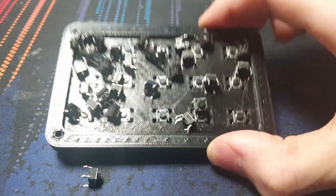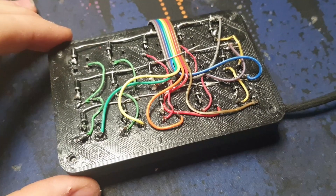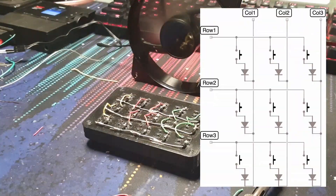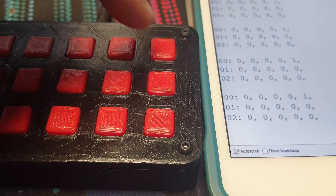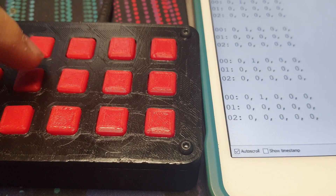With the full size parts done, I installed all 15 buttons and started working on the wiring. It looks complicated and confusing, but all it is is one side of the buttons connecting all of the rows and the other side connecting all of the columns, with one diode per button. With the board mounted in the bottom, it's time to try it out — and it looks like it's working pretty well.